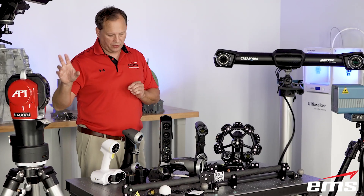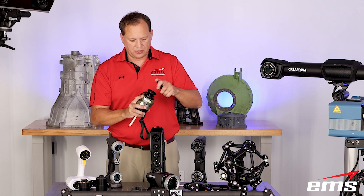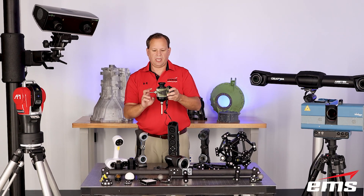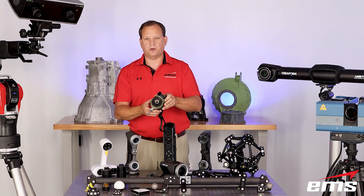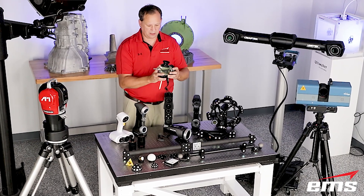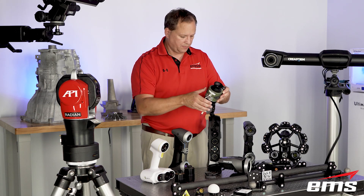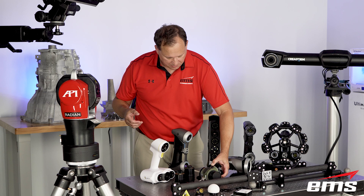This tool is very, very good, and it does have a probing system. Similar to the other system, there's basically a built-in SMR in here, and this system actually has two different probes. We can put different size and different length probe tips on and switch back and forth — maybe we're doing some deeper holes and then some shallower holes. The head is tracking a built-in SMR and there are gyros and different things in here that track its orientation and give you very accurate points.